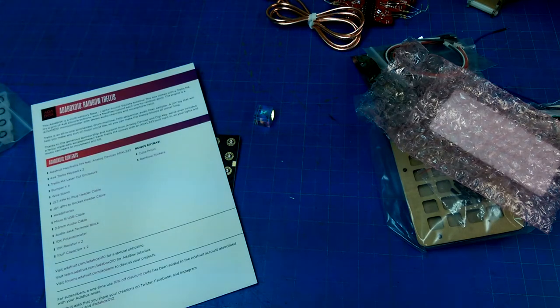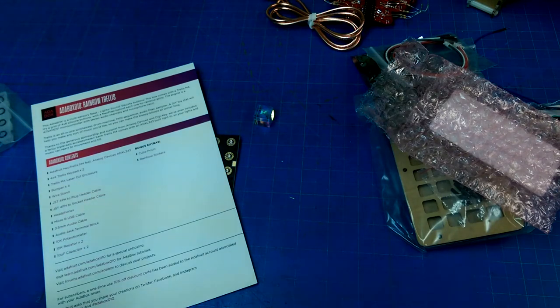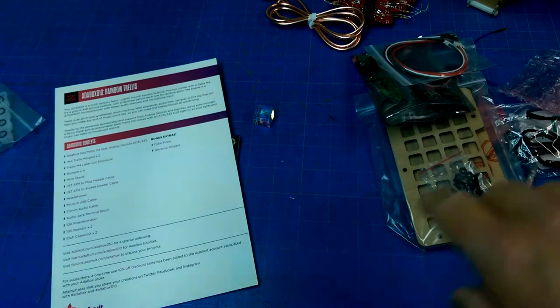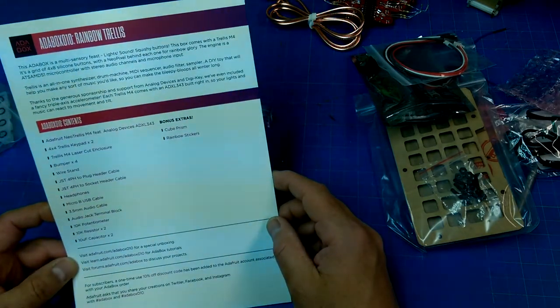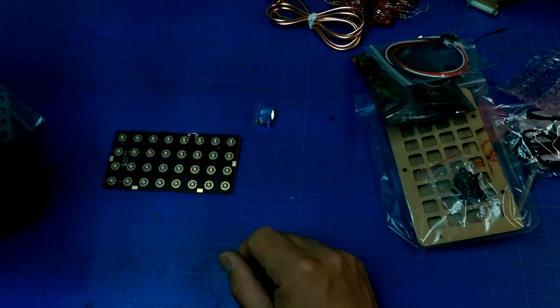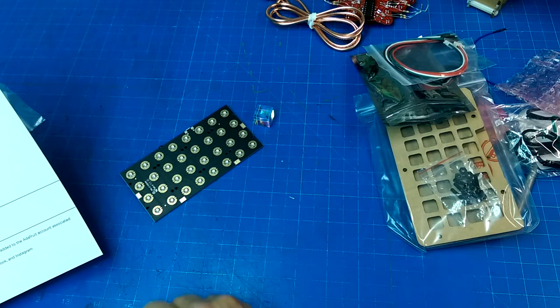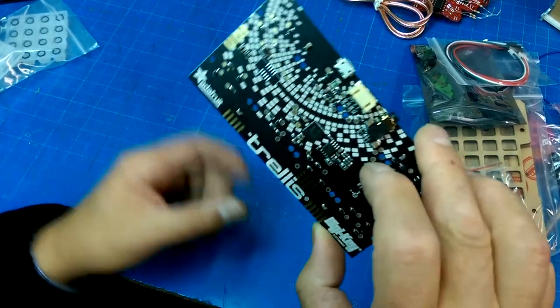Yeah, SAMD51 microcontroller. Stereo audio channels, microphone input. So you can send sounds into it, you can sample things, and it'll send some out. Synthesizer, drum machine, MIDI sequencer, audio filter, sampler, and audio production toy. Now, some of you who have been watching for a while will remember the fun that we had with the Adabox. This is not that. This is going to work. So, let's start playing. Okay, so the SAMD51, a Cortex M4 running at 120 megahertz, and dual DACs.